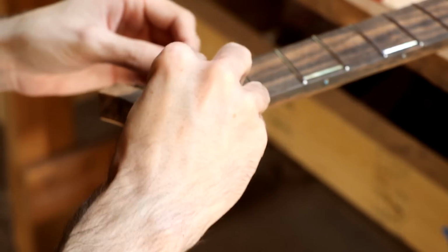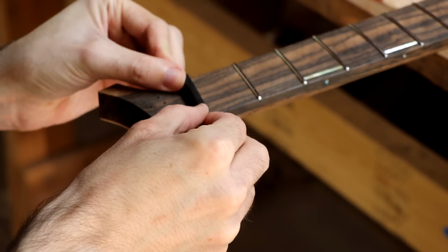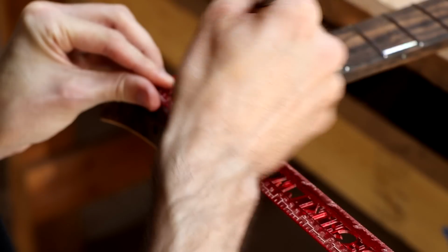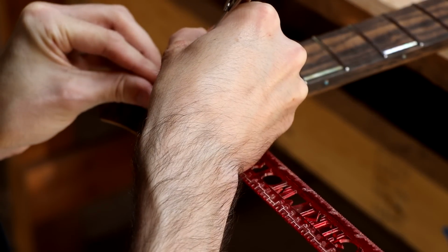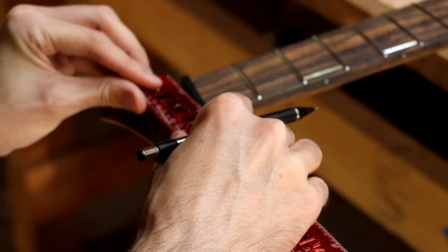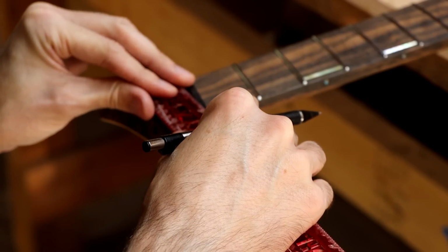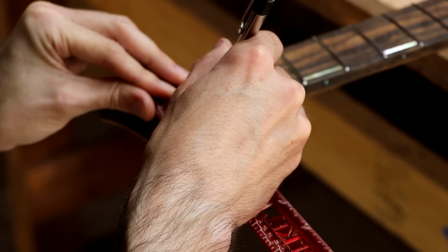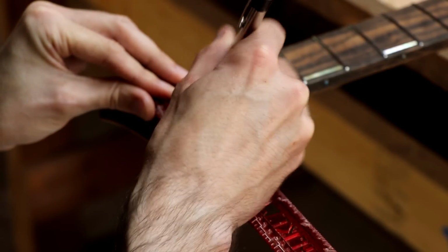I always seem to get a bit scattered at this point in a guitar build and keep thinking, oh yeah, I need to do this, and I almost forgot that. In this case it was, oh yeah, I still need to make the nut. So that's what I'm doing here. First, marking the locations for the outer slots, then using a string spacing ruler, I mark out where the rest need to go, then put a small cut at each mark for the files to follow.